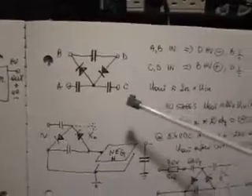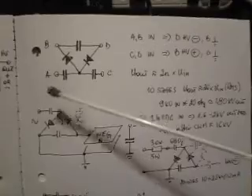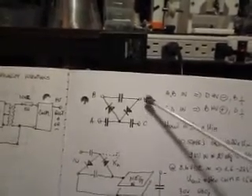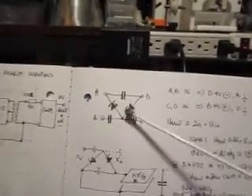I built this so I can study the effect of positive and negative potentials relative to ground. That's a simple way to get this done. I drew this upside down — it should be flipped vertically, as that's how it's usually drawn. Anyway, this is one section of a Cockroft-Walton multiplier: two capacitors, two diodes. If we feed this from the resistor and this part is grounded — treating these as AB inputs — then D will be our high voltage negative output.